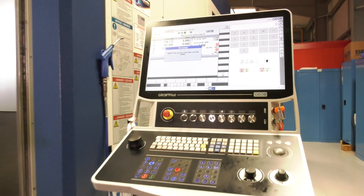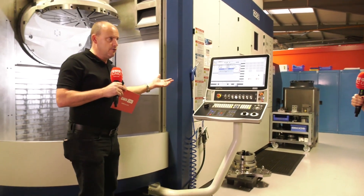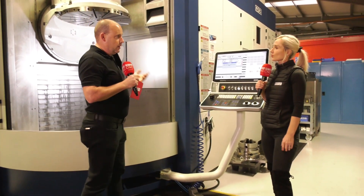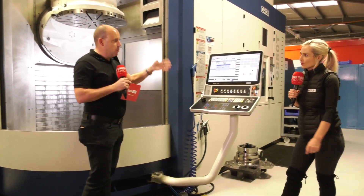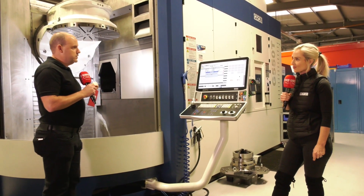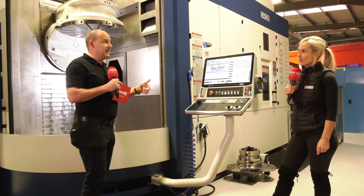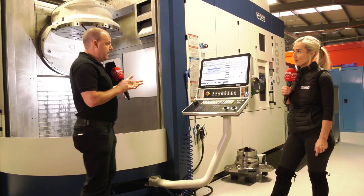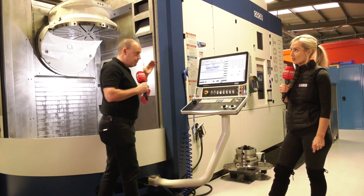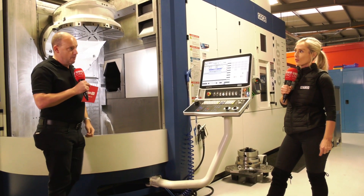The control makes it easier for operators to get to grips with. Most of these machines you'll program with something like HyperMill from Open Mind — whether you're doing full five-axis or five-face machining you'll probably use a CAM system. But you also need monitoring: you need to know this machine is performing as it should, that every aspect mechanically and electronically is serviced to the degree needed to make parts successfully. And if there is a problem, it can be remotely diagnosed by GROB.